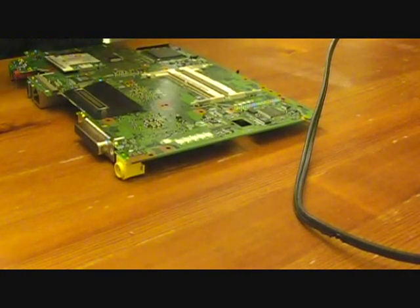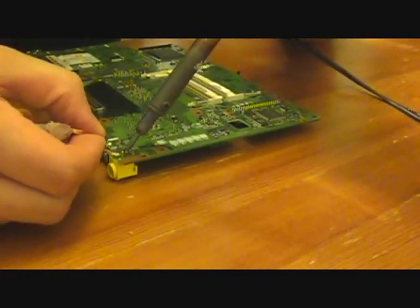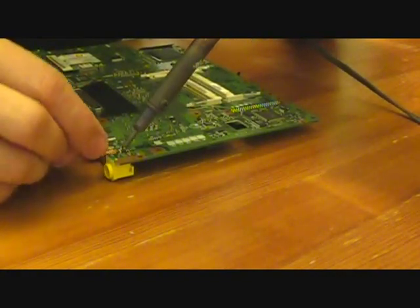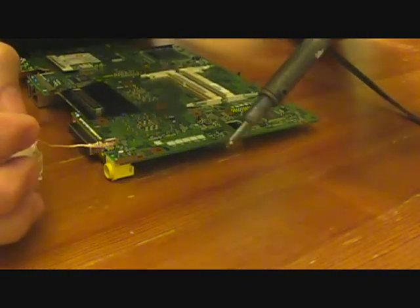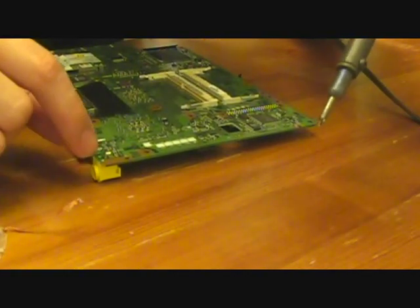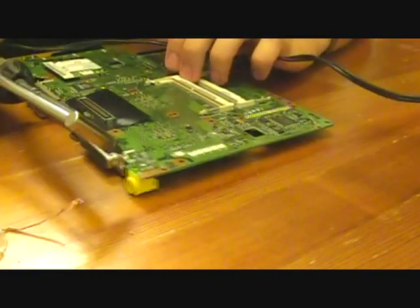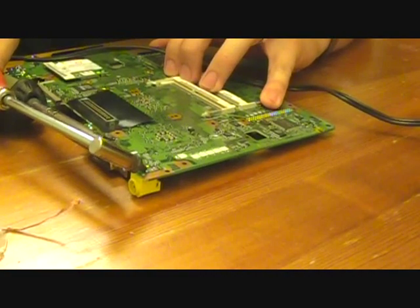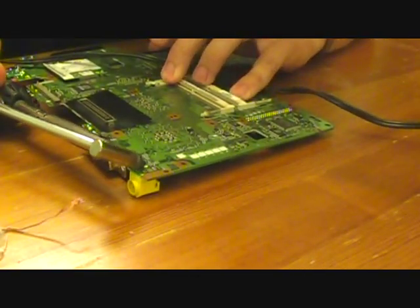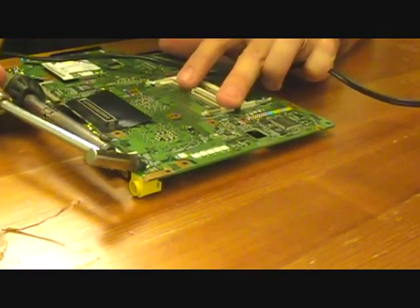We're going to use the braid. Just try not to leave it touching too long — don't burn it. It's kind of a tedious, long process, a little bit at a time. I've got a little bit left on those two which I can get to with the desoldering iron. This desoldering iron doesn't get as hot as my soldering iron, so you sometimes need to leave it on there a little bit longer. Just have to be really careful.